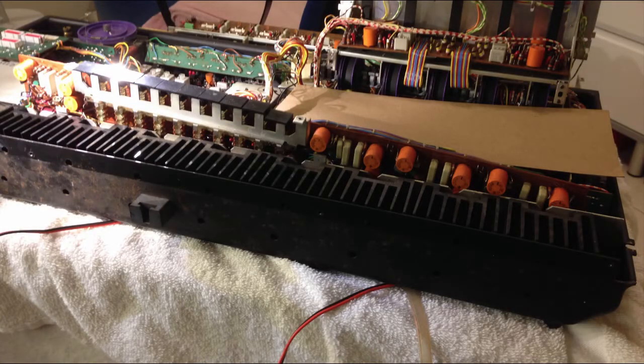After I had the Darlingtons back in, I fired it up and unfortunately had to realize this did not fully fix it. While the heat sink stayed cold, I was not able to adjust with the trimmer any significant voltage across the output resistors. It occurred to me that I may have fried one of the output resistors, and indeed that turned out to be the case.